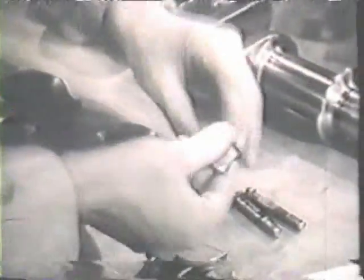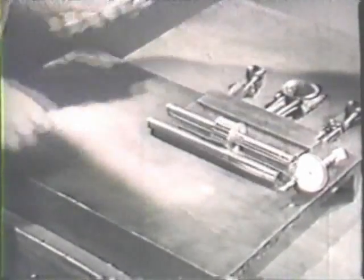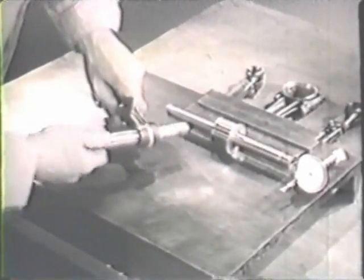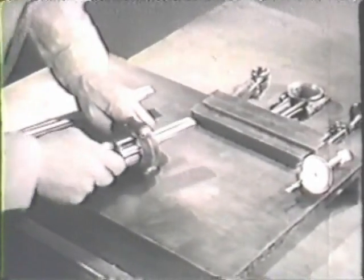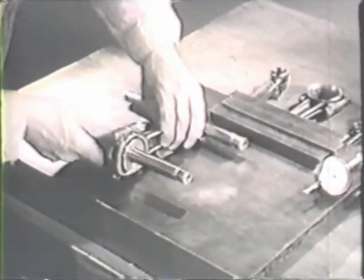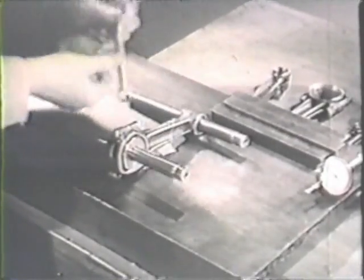So far, this rod is in good condition. Bolt it back together so you can give it a check for possible bend or twist. To make this check, insert a special mandrel through each of the holes in the rod, using shafts that fit snugly. To make the check accurately, tighten the nuts with a wrench.